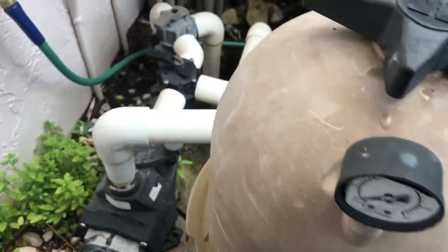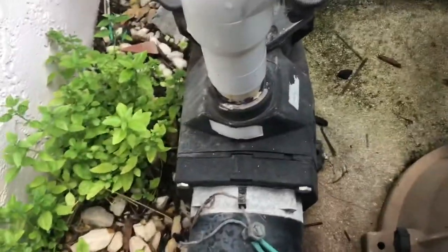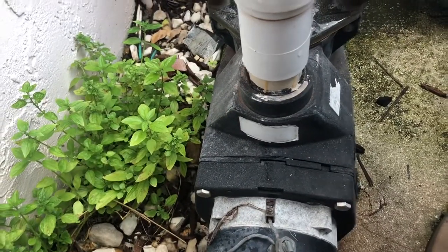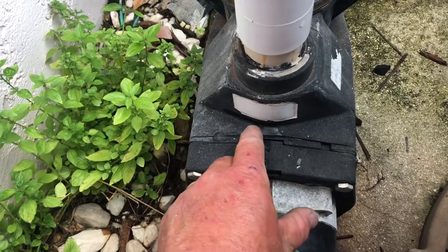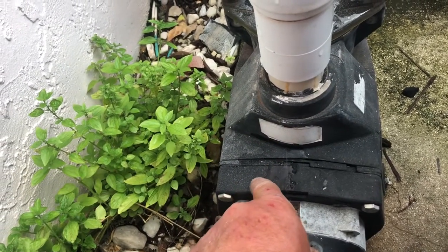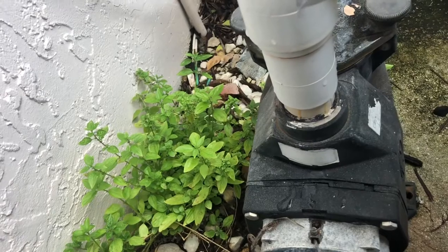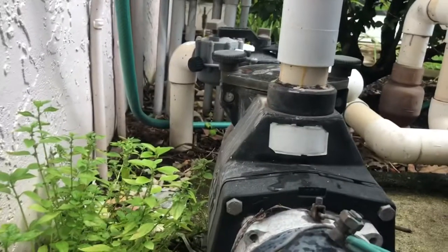So we're going to be wiping it down. I'm going to be pinpointing exactly where it has sprung a leak. It's right there, where it's very notorious, right between these two seams. The reason why this happens a lot of times is high pressure within the system. So we're going to grind down this little area and clean it up, and then start doing our mixture compound to apply it. Let's see if we can get this set up where you can see it.